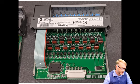We have this sensitive logic down here, which goes to the motherboard via this connector. We have the output terminals here. In the middle, we have the various transistors and diode clamps. And what I'd like to bring your attention to is this device right here. You see there's a whole row of them. These are called photocouplers. What they allow you to do is to isolate one side from the other. They isolate this side, which lives in the mean world, from this side here, which is where the sensitive logic is.